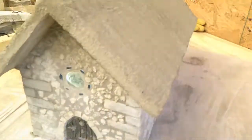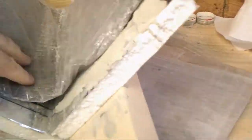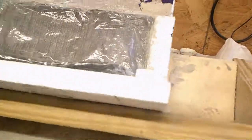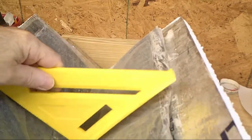Here is the detail of the door — the door was made from a mold I bought on Amazon. You could make your own, but this was less than $10 and saved me a lot of time. For making the roof, I used a floor mat that had ribs in it, wrapped with pre-stretched pallet wrap to keep the concrete from sticking — one of those entrance mats. You make your mold and pour one side, let it harden, then flip it and pour the other. Always make sure you are straight with the speed square.